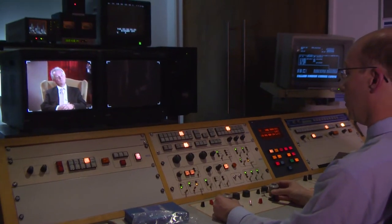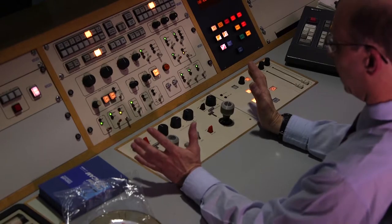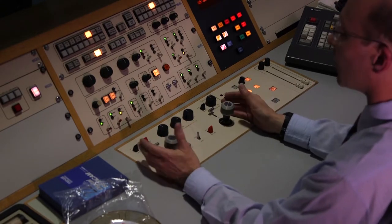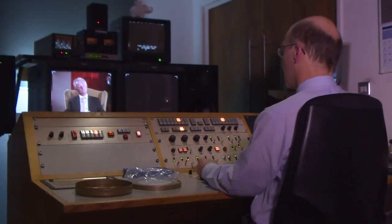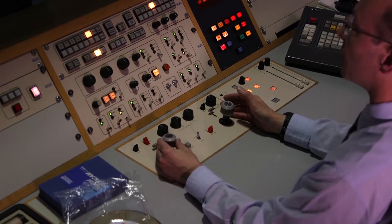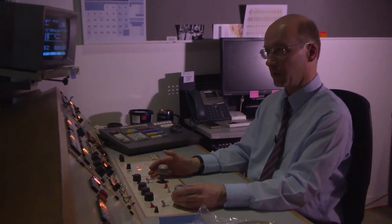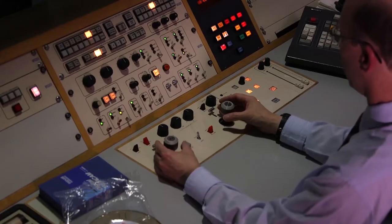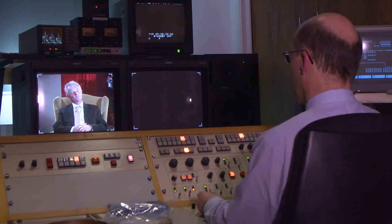The BBC, through experimentation in the early days of colour, came to the conclusion that the most convenient arrangement of adjustments for colour correction live on air was to have two joysticks. The left-hand one — the knob on top adjusts the lift, which is the black level in the picture, and the movement adjusts the colour gamma, which is strictly speaking the mid-tone colour balance. That has the most effect on the look of a picture, rather than colour lift which has less effect and doesn't generally need adjustment between scenes. The right-hand joystick is all to do with the highlights, the whites, the gain — turning the knob on top alters the master gain, and moving the stick affects the colour balance in primarily the highlight areas of the scene.